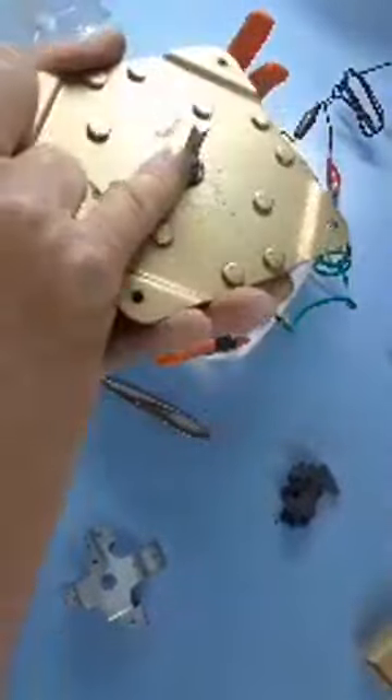You push this to activate the fifth micro switch, and that's for fire. These controllers have a little indent that I had to mill out. Then these fit on and hold it going the same direction as the keyway on the opposite side, so that when you spin it and tighten it down, it clicks with the shaft.